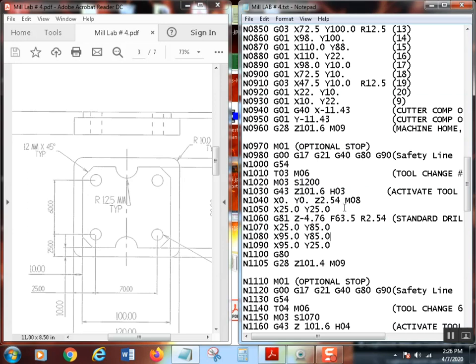Do it like this. You can watch this video several times. That's the neat thing about it. You can go back and totally check it out. So we go to X25, Y25. Then we bring in our G81, which is just a standard drill cycle.